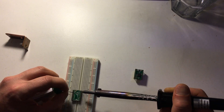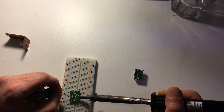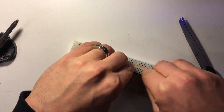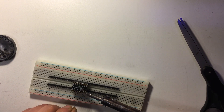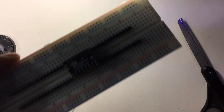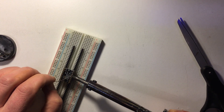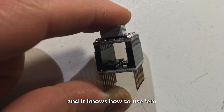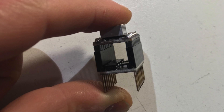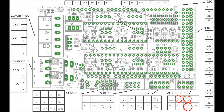First, I'll show you how I solder these together. I'm going to fast-forward because you don't need to watch the whole thing in real time. The driver boards come unassembled, so the easiest way is to use a breadboard — and don't use your favorite breadboard because you're going to drip little blobs of solder in there. We're also going to solder together the silent step stick protectors from Watterott. These are a good idea because there are a few novel ways you can kill these. Just stick them on the breadboard, solder them together, and you end up with something like this with big old long legs.